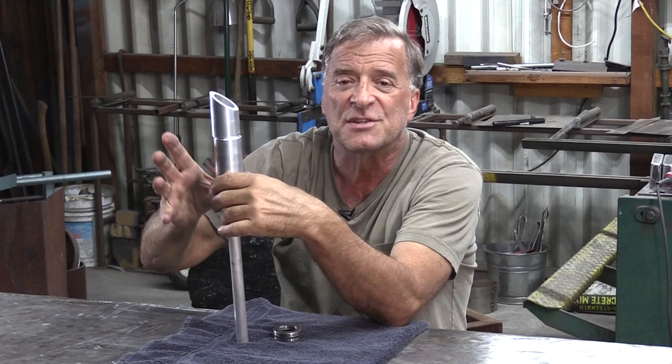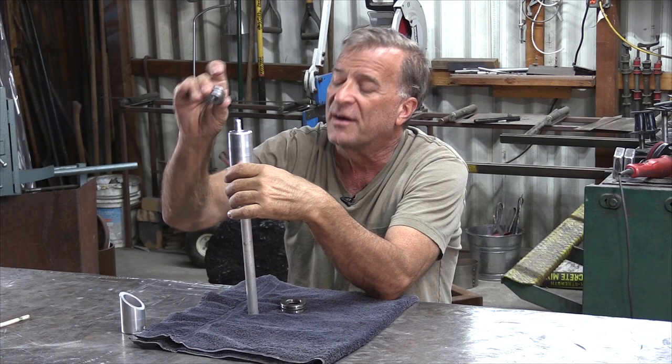So that's the top of the assembly — this angle will actually be welded onto the sculpture itself. This all gets installed in the base. This is the top piece, here is one thrust bearing, and down here is another thrust bearing. All I did was take an aluminum shaft that was too big, turn it down on the lathe, so this thrust bearing actually has a shoulder it can sit on.